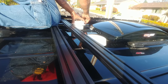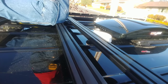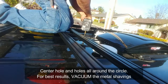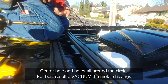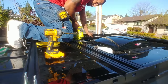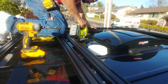You can use the four indentations or just do a center hole and work your way around. We're going to make a center hole and then work the jigsaw back. We got a bunch of holes that basically complete a circle, and we're going to use compressed air so we can see what we're doing and just cut that out. We have a jigsaw with a fully charged battery and a fine metal blade, and we're just going to take our time and work it around the outer parts of those holes.